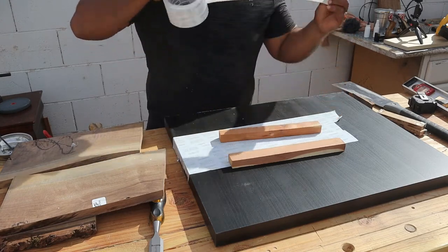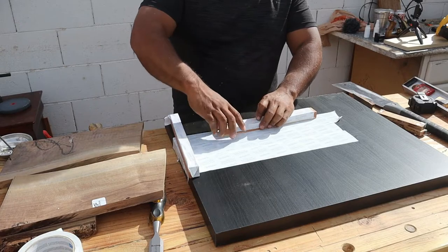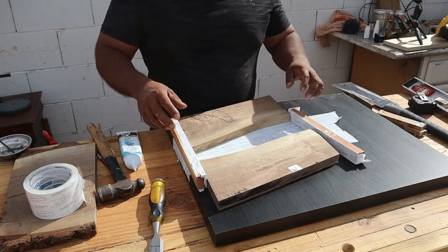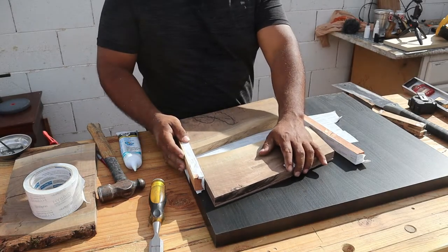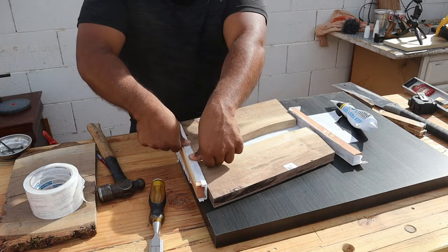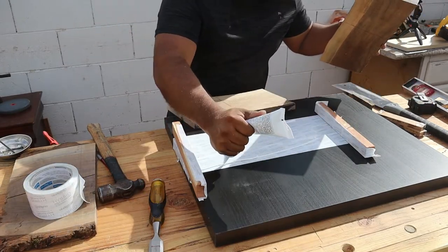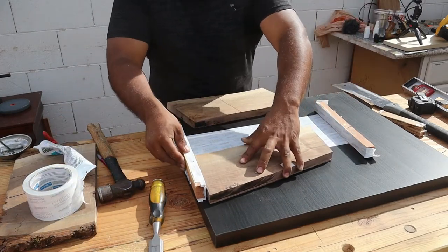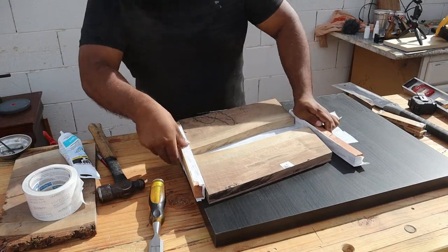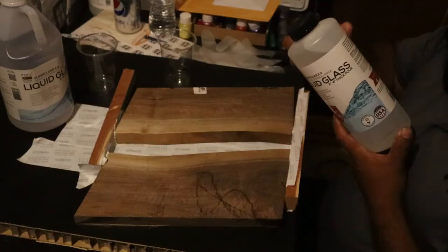I was throwing the mold pieces away so I brought them home and now they're part of my mold. I'm caulking everything down with regular latex painter's caulk — fast drying. If you make it watertight like a roof or bathroom, you shouldn't have any leaks. Not screwing it down, just using caulk at the bottom of my walls, with tape so the epoxy doesn't stick to the wood. The whole mold was basically free — maybe 50 cents worth of caulk and a dollar worth of tape.